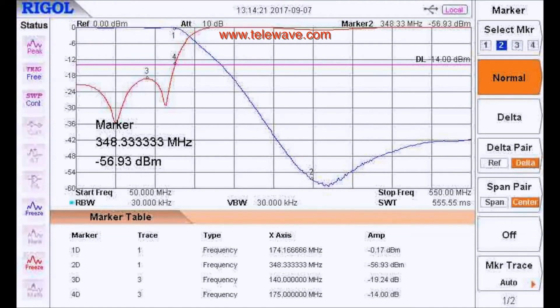There's a little bit of re-entrance on the pattern as you go higher in frequency towards 550 MHz, but that's not untypical of trying to get the second harmonic down for most low-pass filters. This is a good low-pass filter and the match is good — certainly below 175 MHz it's quite good, below 18 to 19 dB. From our passband, we're down about 20 dB around 250 MHz, and from 300 to 550 MHz we're down at least 40 dB.